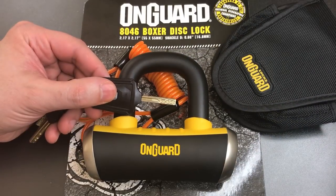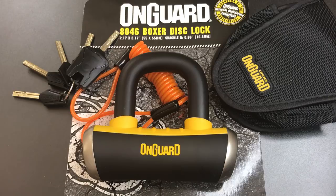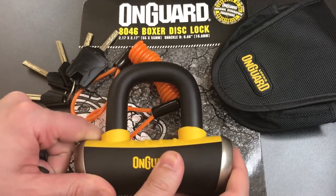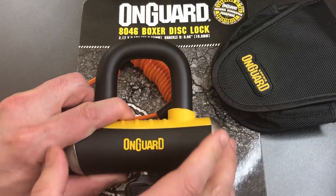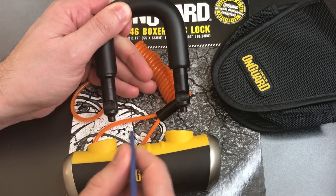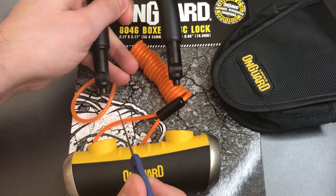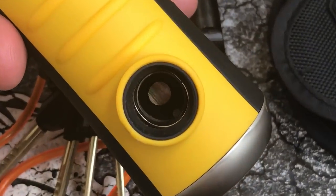What we're going to do today is see just how hard this lock is to pick, and then I'll take it apart as much as I can non-destructively. I wanted to show you the unusual mechanism that OnGuard has for securing the shackle in place. What we're accustomed to seeing are cutouts on the inside of each end of the shackle. Instead, what we have here are cutouts on the front and the back of each side, so we have twice as many cutouts and twice as many locking pawls to interface with them.